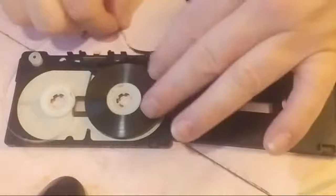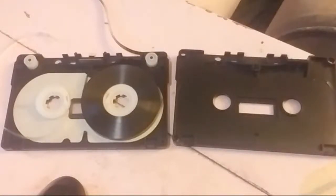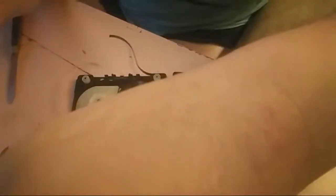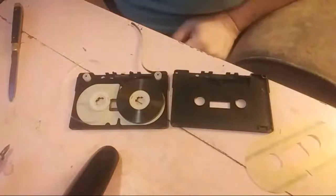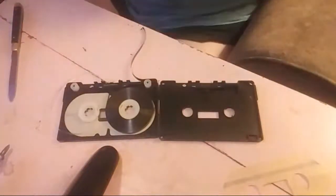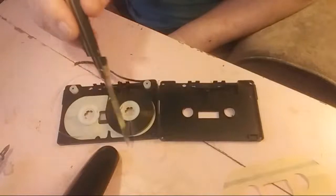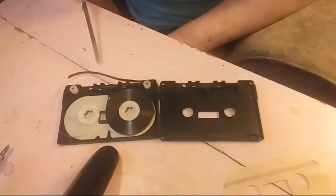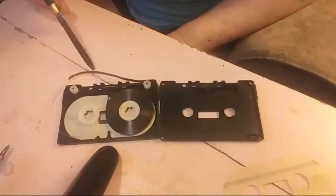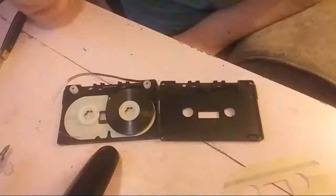What I'm going to do — this is the way I've always done it. I'm using scotch tape here. Along the outside of the tape path — this side of the tape here is the outside of the tape. The heads come from the outside in. So if we're going to use scotch tape — that's all I've got, I don't have any splicing tape — but I've been repairing tapes since I was eight years old. The scotch tape is on the back side, and you want to line it up perfectly.